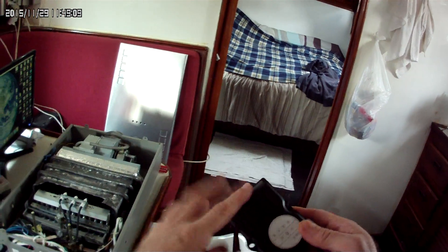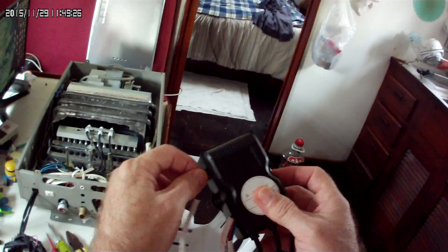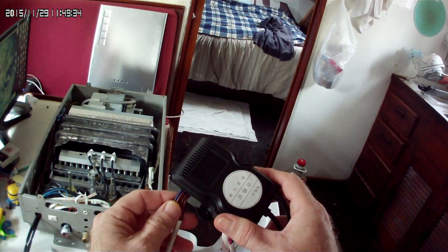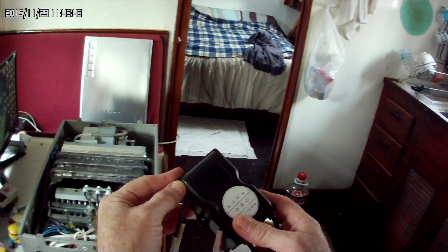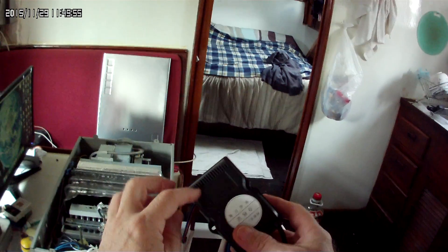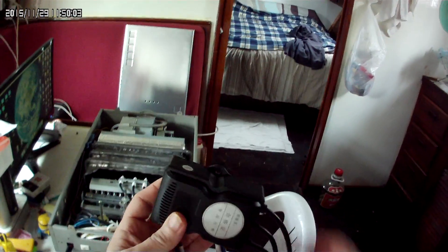What has happened is it's been outside, and as this control has electricity there is heat. There are air vents in here — you can see there are big gaps on the side. One thing I overlooked is I never had them make it with tinned wire — that totally slipped my mind, my mistake — because if it were tinned wire I would not have this problem. One of the wires going to the circuit board inside, where there's about two millimeters of stranded copper wire, the salt air just corroded the copper, it broke, and it shorted out the board.